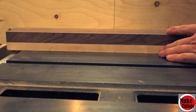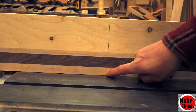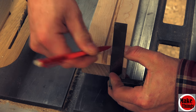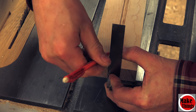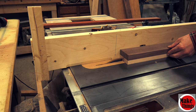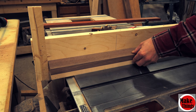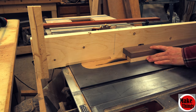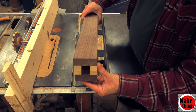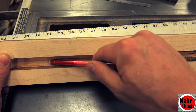As you can see, I have two lines on my jig. The first one is set at 4 inches and the second is at 11. We'll cut through the first line and an inch or so past the second so we don't have to worry about the arc. I nailed my stop block on and made sure it was secure before marking out the width I'll need to cut in my jig. My channel width I decided on was about an inch and it works for me. A few passes through and we're set — just make sure you check the lines you drew as you cut. After the first is cut, do the second the same way. They need to line up when you're done. I transfer the 4 inch and 11 inch mark from the first half to the second half, which will be important for a pin that will run in the channel.